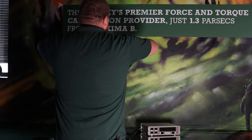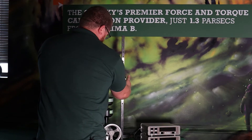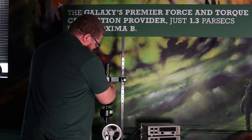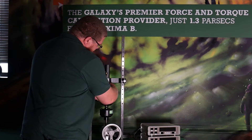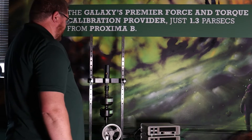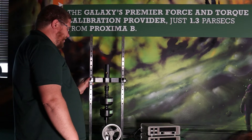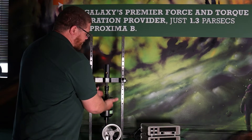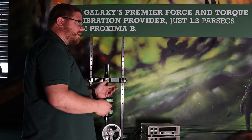We pull out on these pins and lower the stage beam down to where you need it. You'll need a little bit of room to thread the tension adapter all the way onto the unit under test, so leave the stage beam free-floating — it's not going to go anywhere. Thread that down on there, and don't jam it — it's important. Once that's in there, adjust it until the retention pins lock into place. You may need to move things up or down a little bit to get the stage beam to line up with one of those holes.